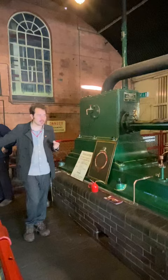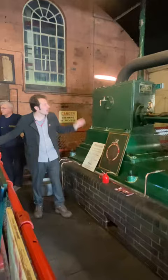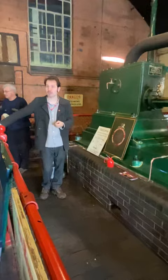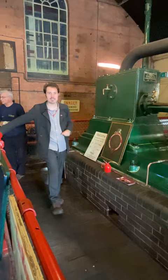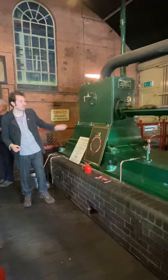At the end we have this box — a condenser. Inside, the steam comes in and is hit by a jet of cold water. The first thing you get from that reaction is hot water — and that hot water from the condenser goes back into the boiler to go through the cycle again. When the steam condenses into water it also decreases in pressure, creating a partial vacuum. We can use that low pressure to pull on the piston inside the condenser. So the high pressure cylinders push the pistons, and the low pressure condenser pulls on the piston — all three working together.